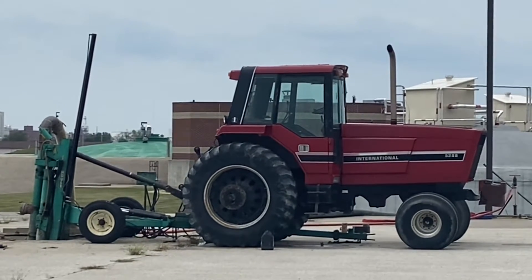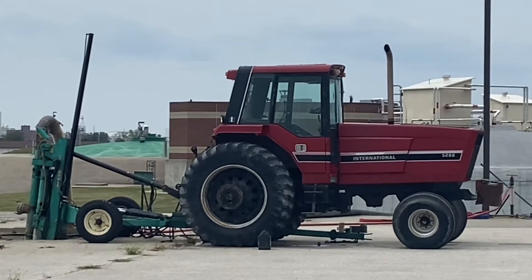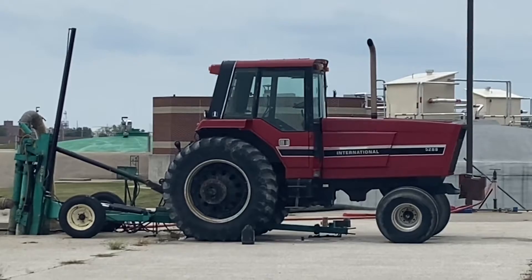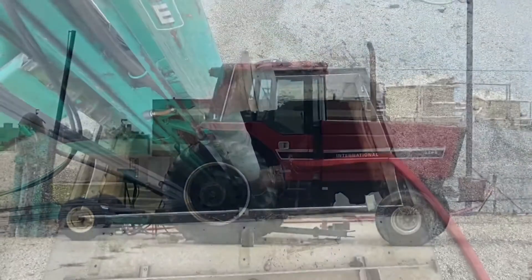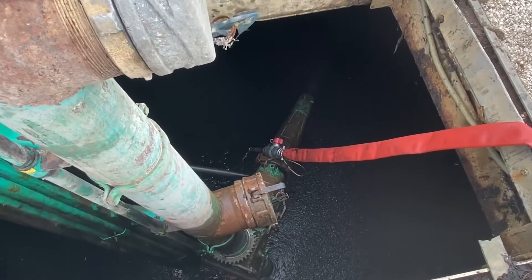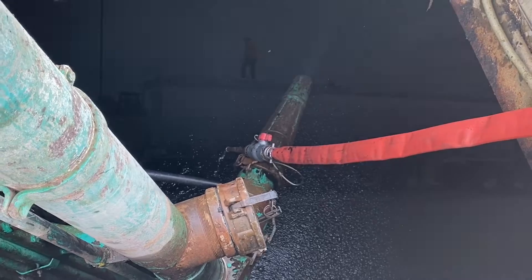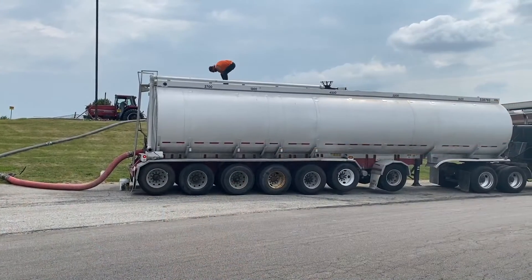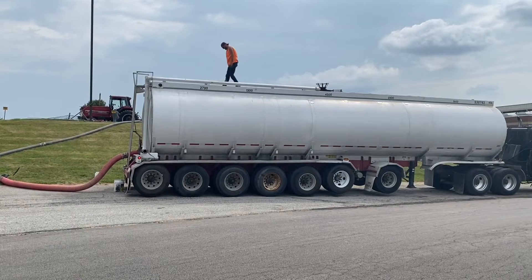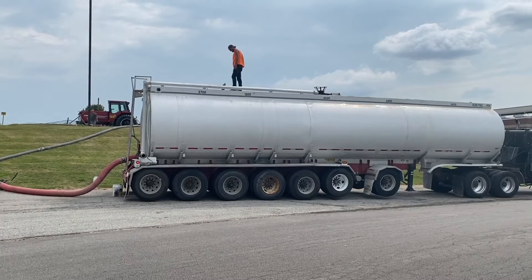The tank is about 12 feet deep where the pump is, and then another two-foot deep sump pit that we try to sink the pump into to remove the solids completely. When we're talking solids here, this is about 8% thick liquid, which is the consistency of a thick pudding. The pump mixes the solids in the tank to keep a more consistent product so it is easier to pump out. We then use the hauling pump to fill an 11,000 gallon tanker with the biosolids liquid, which we'll then take out to the land application site.